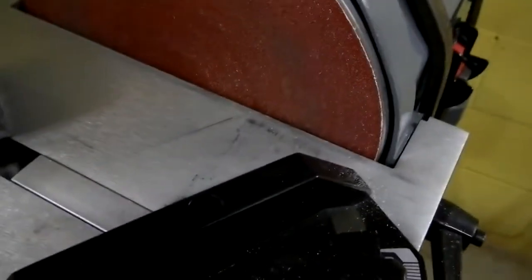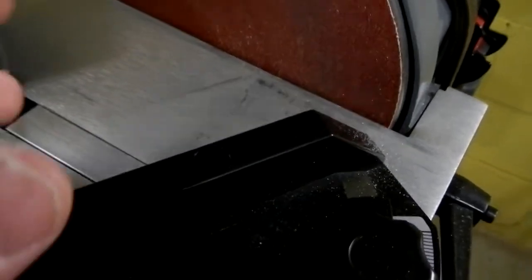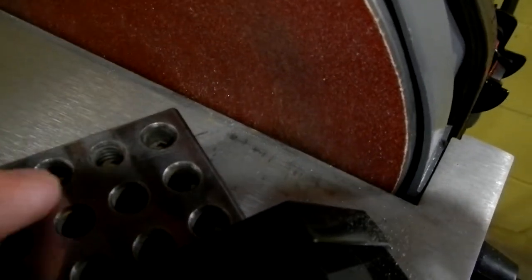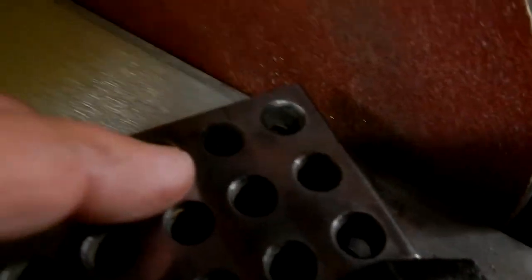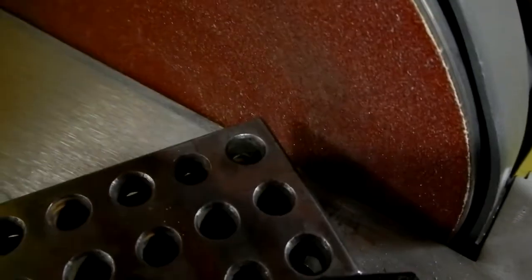Now, I've got some expensive, in fact, I have a master set of gauge blocks. Well, they're 1x1. It would have been nicer to have something a little thinner in here. Well, I sure wasn't going to do that. I didn't want to use any expensive gauge blocks. So I just took some of these 1-2-3 blocks that I keep in my basement for things on my drill press. And I needed to extend this line out, if you can see. You put that part on there, not enough was going to be hitting this fence. So by extending it just this way and just holding this, okay, I was able to put the part on here and work it, and I'll show you.